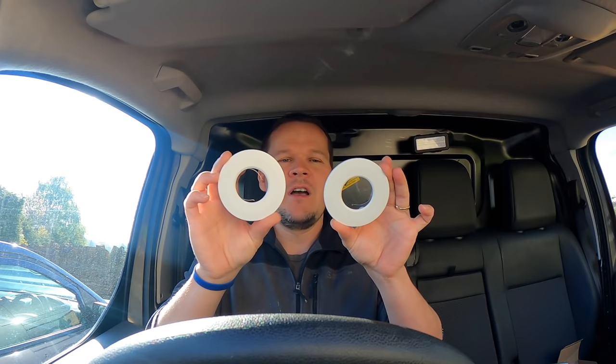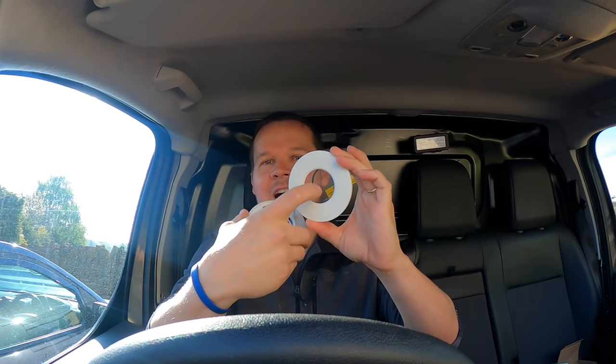One thing I do like is the bezels. Believe it or not, that's an IP20 and that is an IP65. And as you can tell, there's no difference, look. So that one's got a glass in it and that one hasn't, look. So that's really nice. If you're fitting these in different rooms, like in a bathroom, where you've got one over the top, or a big open plan place, you want to put some IP65 ones. They do look no different, basically, but they're going to give you the protection that you need.